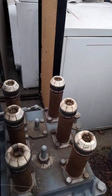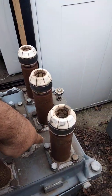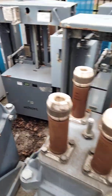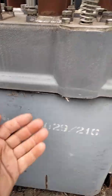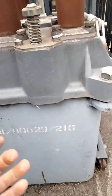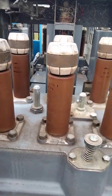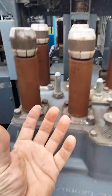Down inside here and underneath, this is your oil — your oil chamber sits right down at the very bottom. So we have an oil chamber down here. There's a contactor that pushes up and down and comes to these fingers. There's a contact that sits across each of these fingers — one, two, three — like a big contactor that'll come up and close the contacts.